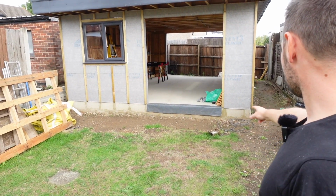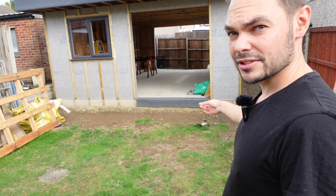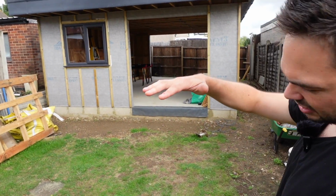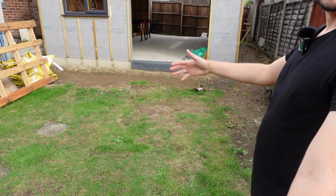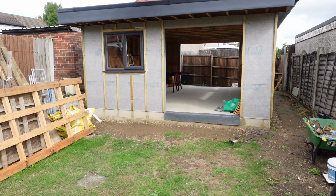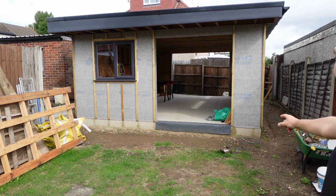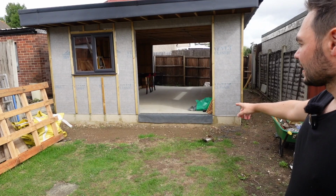So I did it all myself, and I ordered all the concrete for the strip foundations, which are deep and wide as well. And that's what you said, 5 meters by 7, and half a meter deep. Jeez. I'll send you footage and photos of it all if you want. So that's 14 or 15 cubic meters.